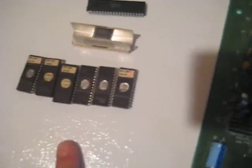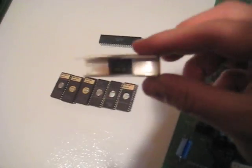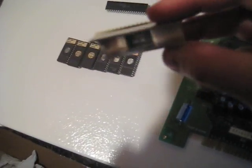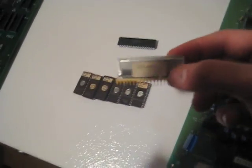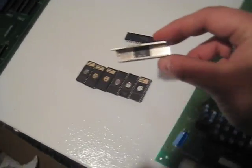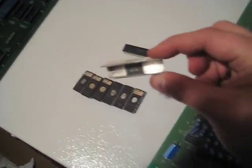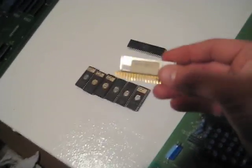So what is a game? For the most part, a game is comprised of six ROMs — this contains the game data — and a PPU, which is kind of a security chip. This actually has color information on it, and if you use the wrong PPU with the wrong set of ROMs, you'll actually see the wrong colors. It's my understanding that if you use the wrong PPU, you'll still see the game, but the colors will be messed up.